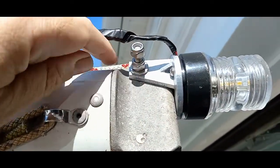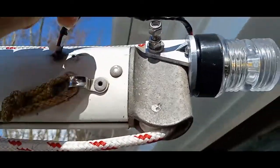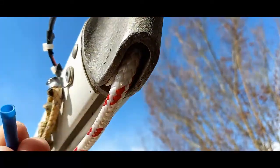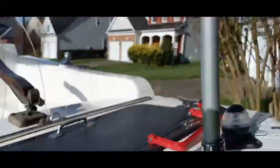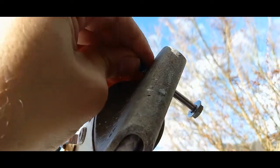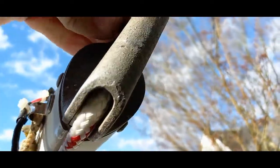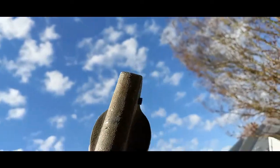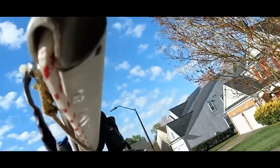That was the pin — a quarter inch. There was another one up here. You drill the head off it and then drive it out with a punch, and keep the punch in there so you don't lose the roller. And then what I found is these blue splices are about the same width. So what I can do is, when I take this bolt out — or if you're taking the pin out so you don't lose the roller — you can push the splice, the bolt out using the splice. And that way you won't lose the roller down in the mast.